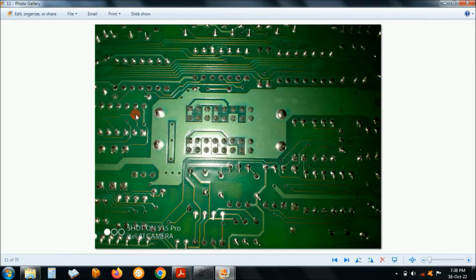So what we can discuss here is the 12 to 15 volt supply, this part here, which also goes to there. This broad track here is actually the ground. So we have the ground here, the ground there, and the ground here. Here are the pulse width modulation cables. You have the high side and the lower side here. You still have to identify which one is going where.